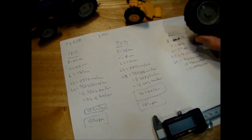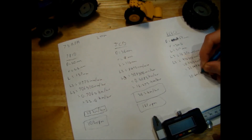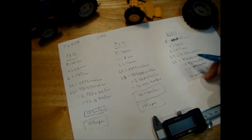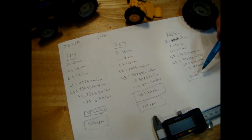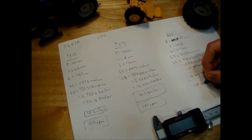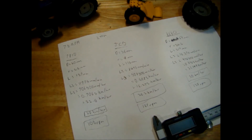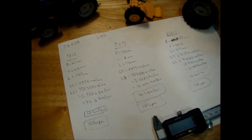For the Massey 8680, the top speed was around 50 km/h. We're currently getting 31.25 km/h, which is 62.5% of 50 km/h. So we divide 75 by 62.5 and multiply by 100, giving us a required 120 RPM motor to achieve the actual top speed of the 8680 model.